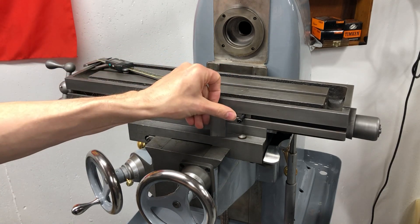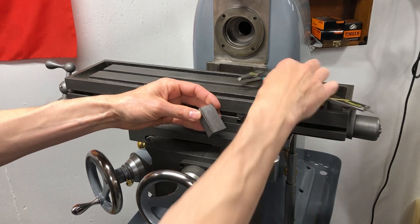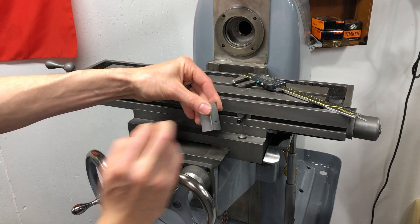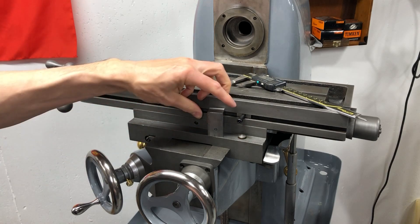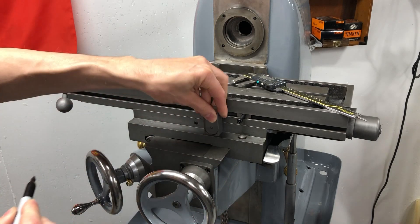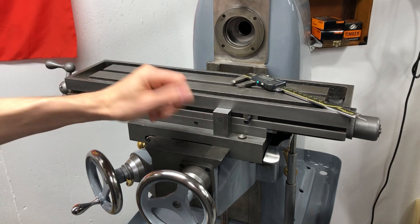After that I'm going to spin it around to the backside. We'll center up on here — it should be about an inch — move up a half an inch, and I'm going to put another hole in here, only probably halfway through. I'm going to use 3/16ths just because I have a dowel pin that's 3/16ths, and I'm going to use this to help me index it in the vise in order to cut a radius around this bottom edge so that it travels along and contacts this smoothly. That hole will only be on the back — you won't see it from the front.